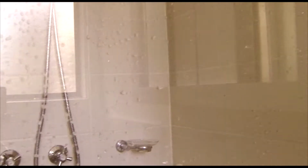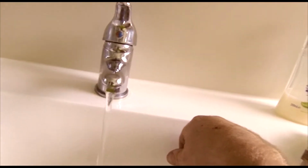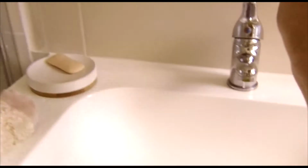Once the water's been turned off at the front, what we need to do is let the water pressure go within the pipes. Or when we go over to the shower over there, what'll happen is we'll get wet. So we'll let it go. Now that should let the water pressure out, and you'll know that you've turned the water off properly if the water in this tap, or just another tap in the house somewhere, goes off. So that's let the water pressure out.